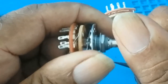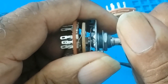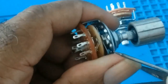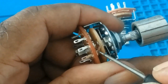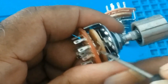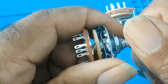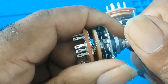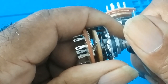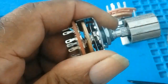So to eliminate that problem, you would have to file here — bring it as low as possible. So when you turn the knob and the brush reaches here, it will be floating. Then you continue, it will be floating all the time. That means it disconnects from here, then it touches the other one.